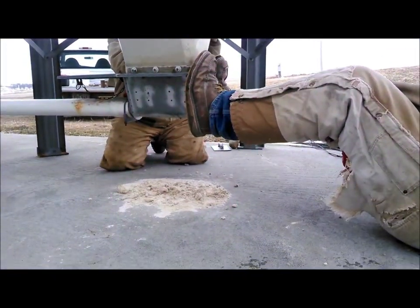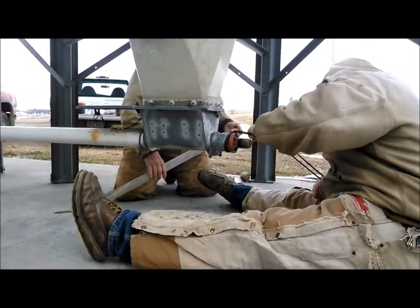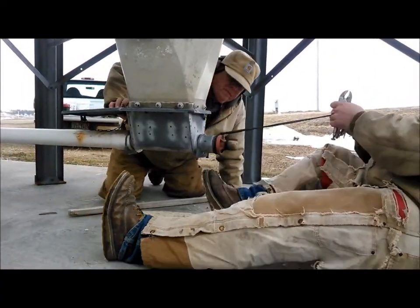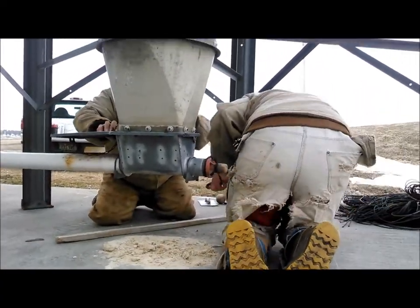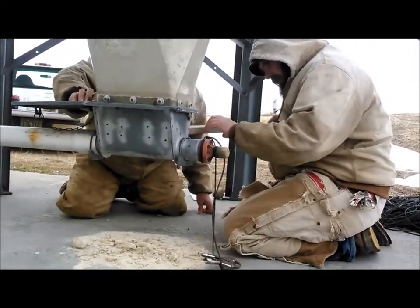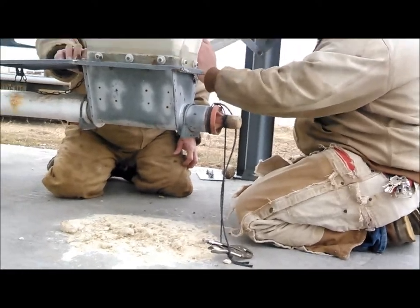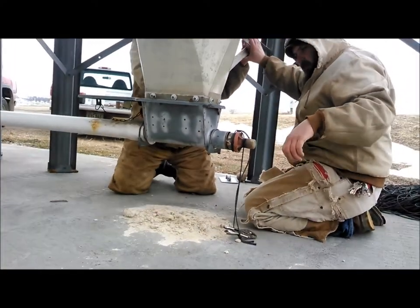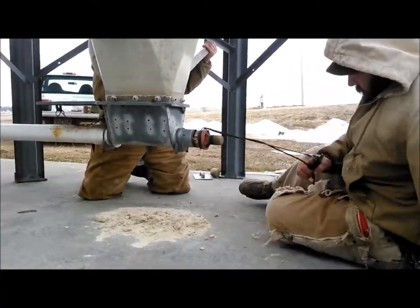And there I am, pulling the auger out. But what we're doing here is replacing some feed tubes. So that white tube you see is the tube, and there's flighting inside of it. Well, the tube wears thin after 13 years in a hog house. So we have to replace some chunks, and you'll see it here later in the video. And we got to pull that out, and it's quite a complicated process.